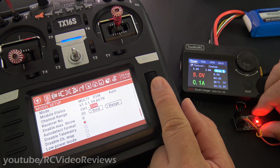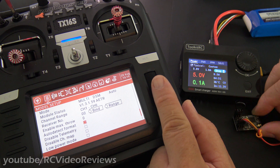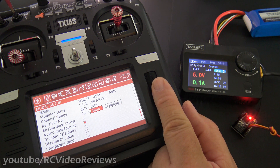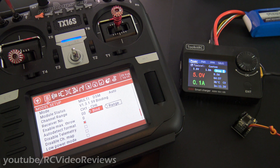I'm not sure why, but mine defaults to seven. Then set it on auto detect format and click on bind. When you click on bind, you should see it stop blinking, then it'll slow blink, and then it'll go solid. There we go.